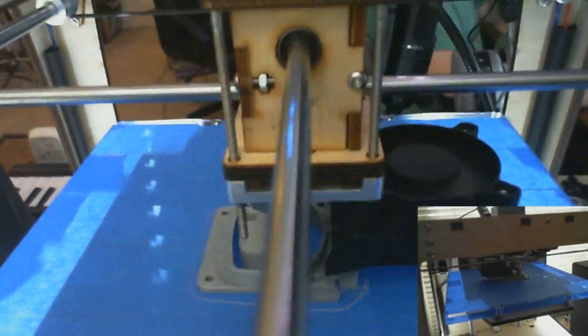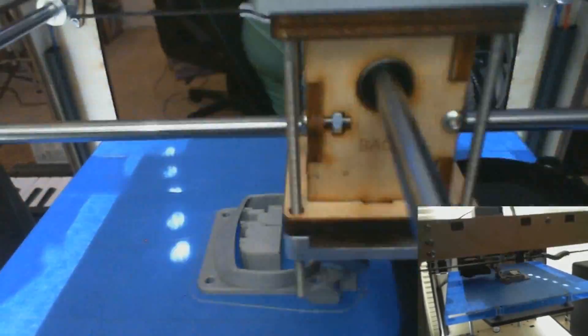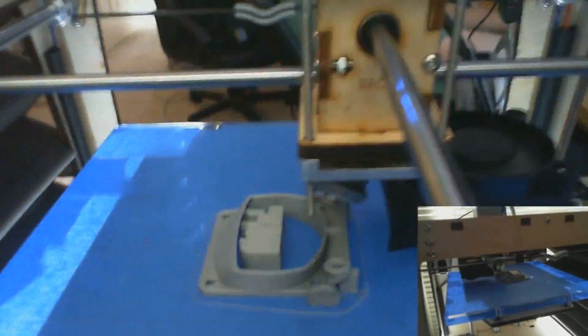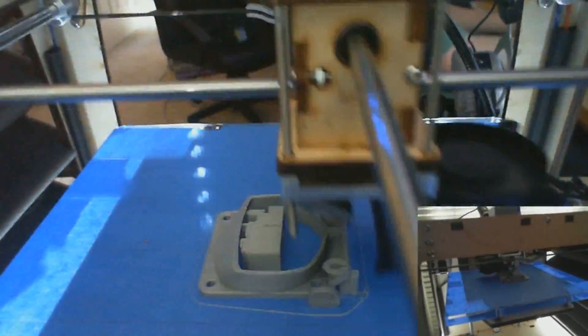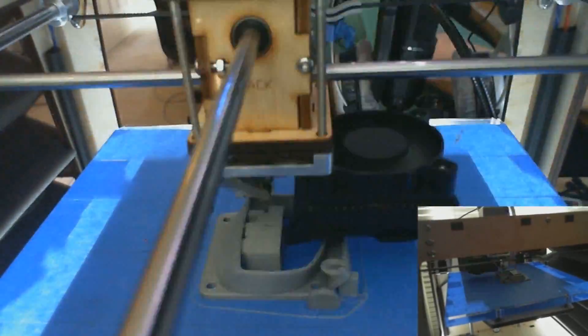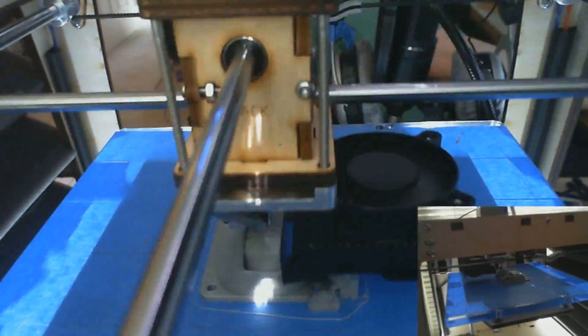There are two different models of this printer shroud. This specific one is a clip-on version — you literally just slide it onto the two bolts that protrude out of the bottom of the head, and you don't have to put any bolts on to hold it. So it lightens the print head, and anything you can do to save weight on the print head is a good thing because it improves the accuracy and speed.